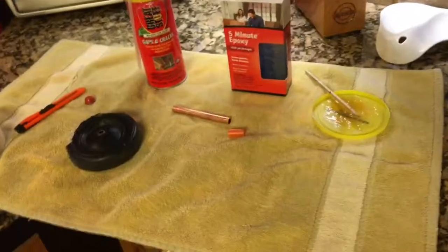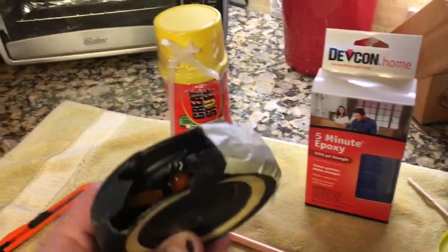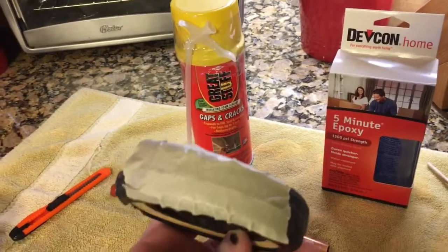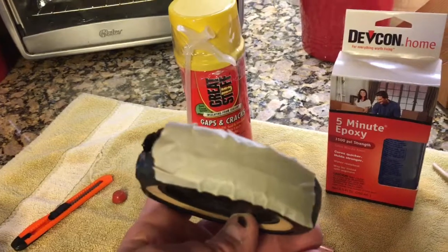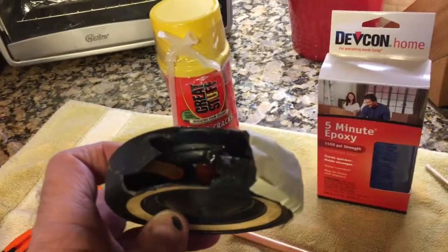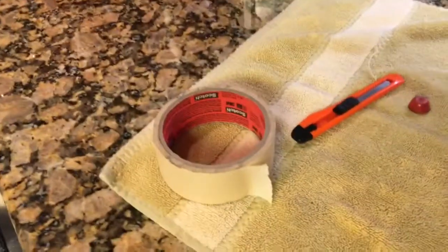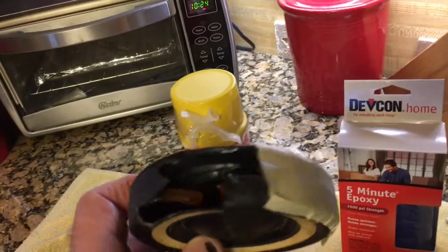In order to epoxy the wheel halves back together, what I decided to do was to tape the wheel together for 2 reasons. One, to keep the joint together. Secondly, to make sure the epoxy would not run out. And I used just regular masking tape. Any kind of tape that is non-stretch will do fine.